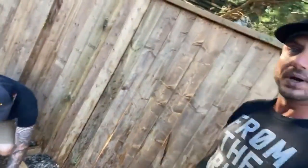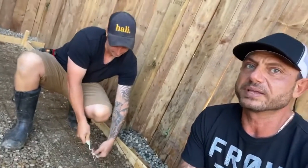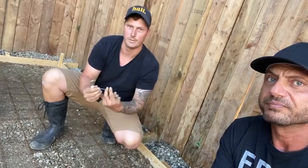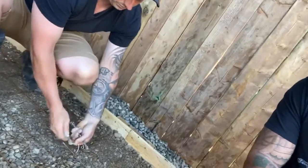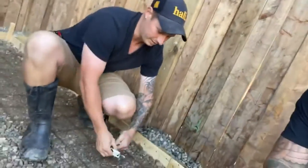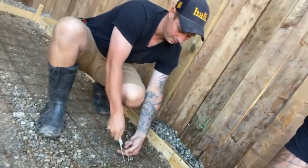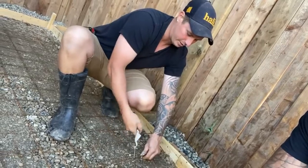So TJ, right now what are you doing? We are tying all of the wire mesh together so that we don't have any spots that are loose. So what does the wire mesh do? This is basically concrete insurance so that you don't have to worry about any cracking happening — this way to make sure you are safe and covered. So these ties, how do you tie them together? We have aluminum wire ties, we stick them underneath the wire mesh and we have the old-fashioned wire tier — handiest tool around — and you just twist them, tie them together so they cannot come apart at all.